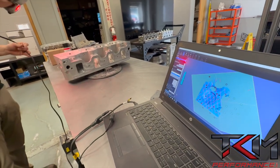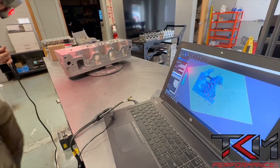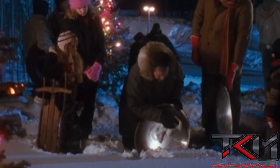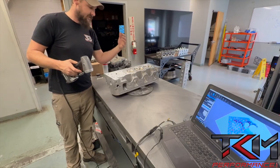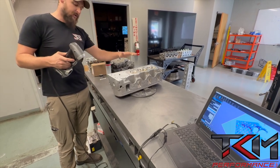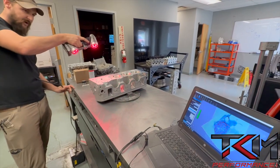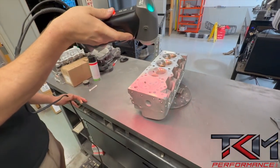That's how it gathers all that data — basically connects all the triangles together. Because of the way it reflects, I had to spray it with a white developer spray. This is a non-aerosol silicon-based coating, and what it does is cut down on the noise — that's what it's called for the reflection. Because the stickers are reflective, that's the only reflection you want back in the camera. You spray it with the white developer spray and it just wipes right off. Essentially it's just taking pictures and connecting the dots — millions of them at a time — in the software. From there you'll have the STL file of the model.